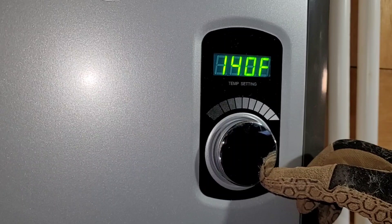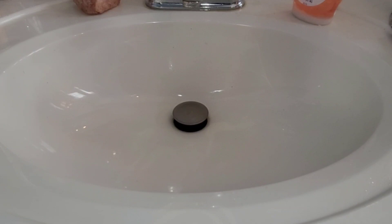Now that we've set ours to 140 degrees Fahrenheit, let's go test it out at the faucet. Before we start, this unit was installed in central Virginia, so if you're in a different area your results may be slightly different. Also, the directions say not to exceed 40 feet as a run from the hot water tank to your furthest sink or shower. Mine are only within about 25 feet, and this sink is actually within 15 feet.